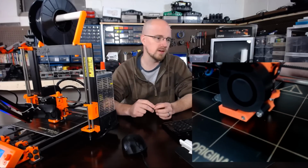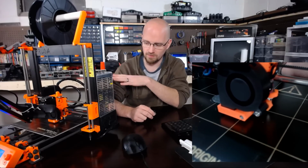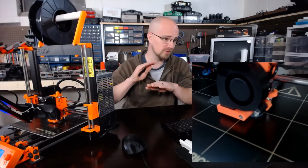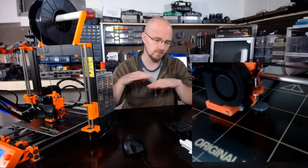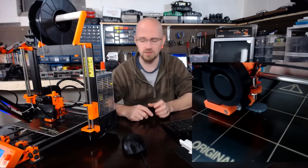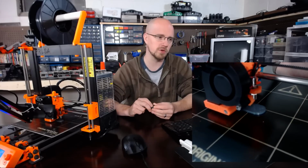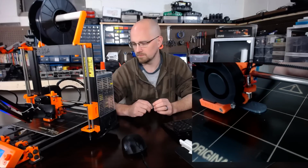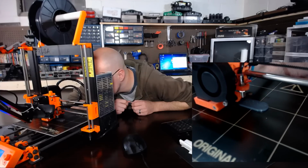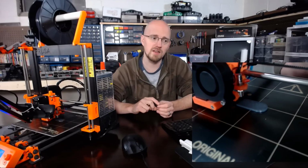That's what I was talking about with having more than 2 top layers: it will fix any problems like that you've had. If there are tiny imperfections in that first layer, the second layer will normalize some of them out, and then the next layer will do it even more, and with 4 layers, it'll give us a nice, even surface across the top. But like I said, I have a feeling this is a few degrees too hot for this filament. I know you can't really see it on that camera there, but that's not a perfect layer it's putting down.